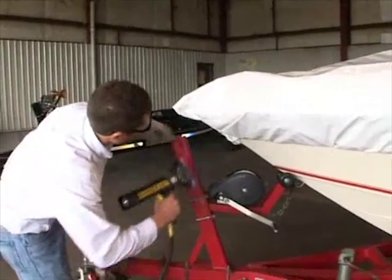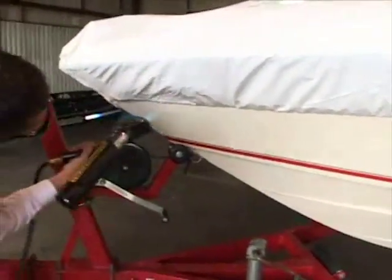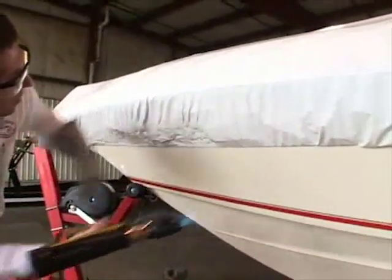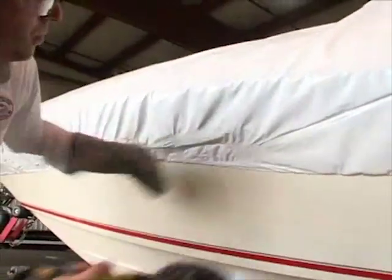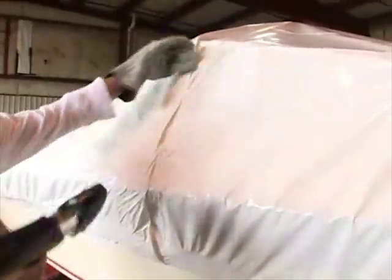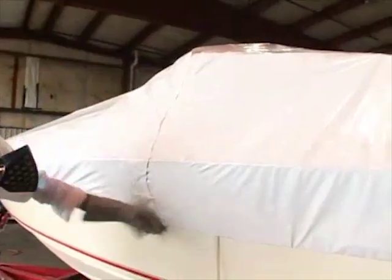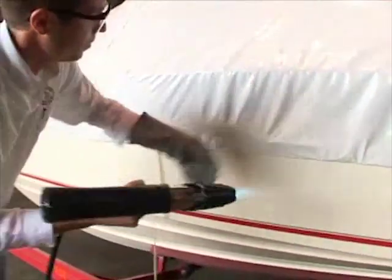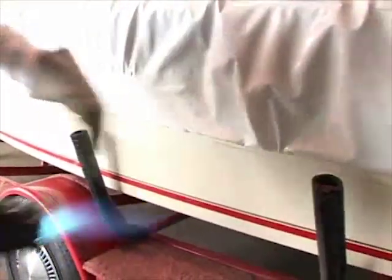Now it's time to use the heat tool to make a heat weld — we're actually putting a hem in the cover where he'll run the heat tool in a horizontal fashion, the flame itself, right above the perimeter band. He's using the back of his hand to pat the material and that fuses the pieces together so the perimeter band is actually sealed into the base of the cover. You only need a couple inches of heat weld to make it work well. Now as you come to a pleat you want to do the pleats at the same time as you're going around the boat, so when you're done going around you're ready to begin shrinking the cover. You can shoot heat into the pleats and pat it shut with the back of your hand, making sure that you're wearing your glove. The heat will be horizontal just above the perimeter band. This is a beautiful use of the shrink fast heat tool and it goes very quickly. This is why you only want a couple or three or four inches of material tucked in above the perimeter band.